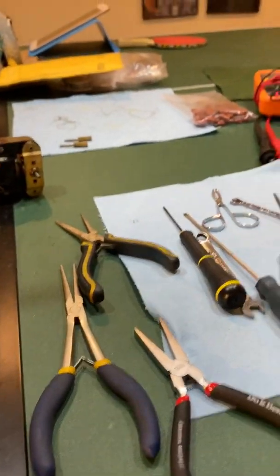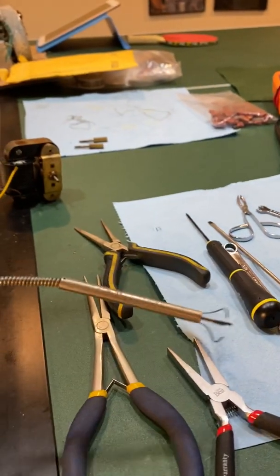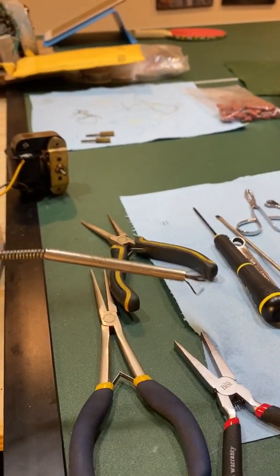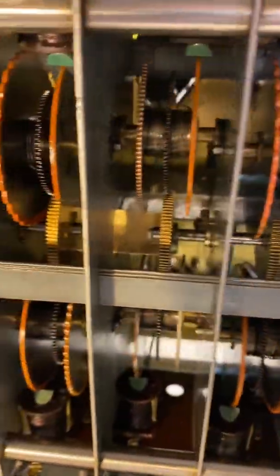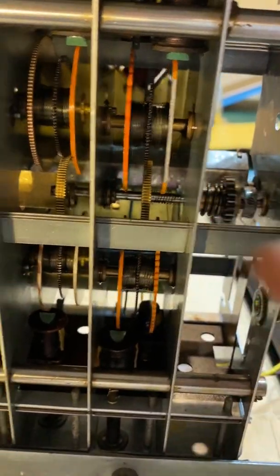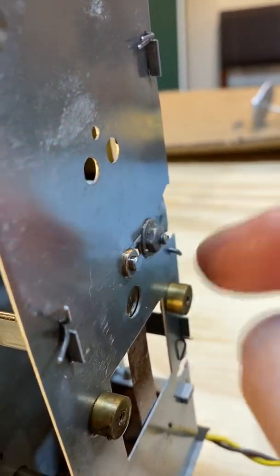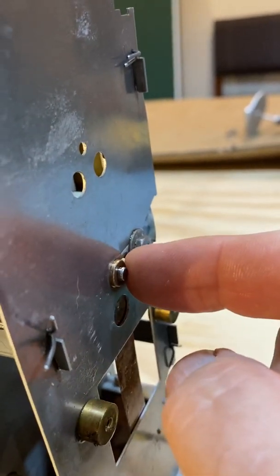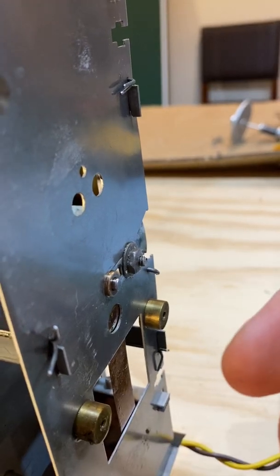This little item was very handy for trying to fish the piece out after I dropped it five or six or seven times. The method I used to fix this: there is some play in the shaft at the end. There's actually a tensioner that holds this bearing in, so I loosened off the tension — I found this out through trial and error, trust me.